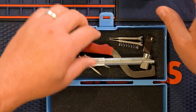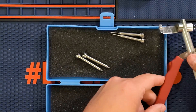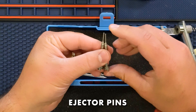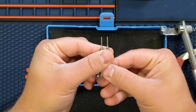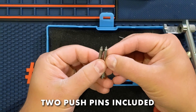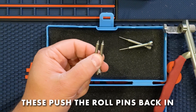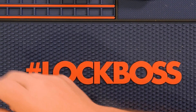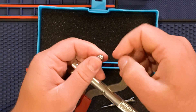So without further ado, let's dive right into it and have a little bit of fun. Now before we start, let's first talk about this little kit here. It's really basic and simple. This is the tool right here, but I really want to talk about these for a minute. I like to call these the ejector pins — these are going to push the roll pin out. It does come with two and they are the exact same size. And then you're also going to get two of what I like to call push pins. You'll see in a minute when we go to insert the roll pin back in — these are really nice for pushing them in.